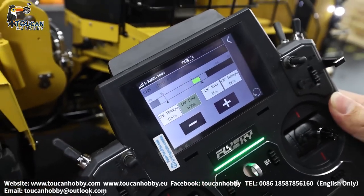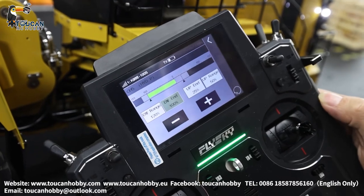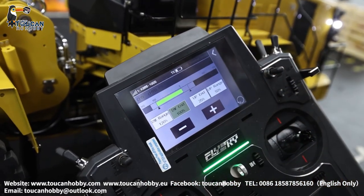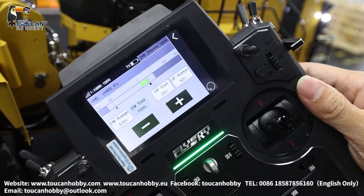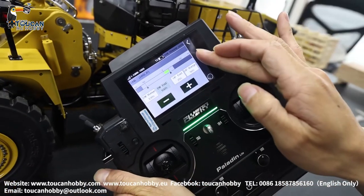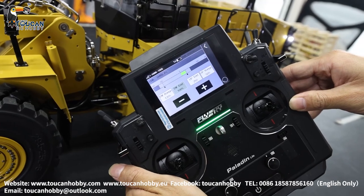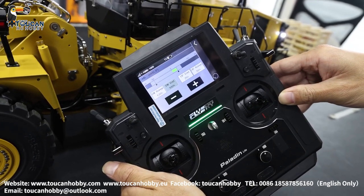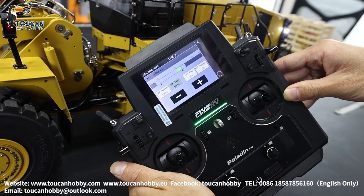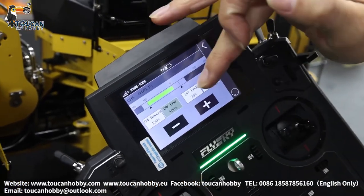So let's start to see. Coming to right side 25 percent — so this pump starts with 100 load. It is from negative 100 percent to positive 100 percent, that is 100 percent load. So now this pump: 100 plus 25, that's 125. But the other side for the right side still has 75 left. So around 125 to 200 — it is around 62.5 percent. That's the pump load. So we set up 50 percent for the right side for the maximum.